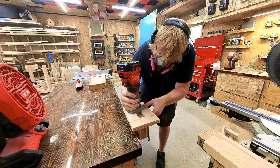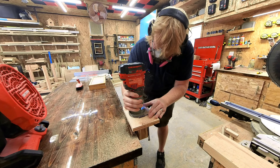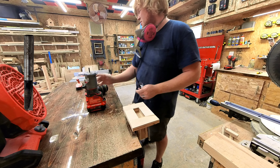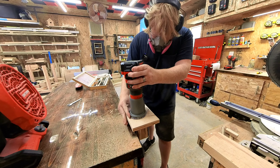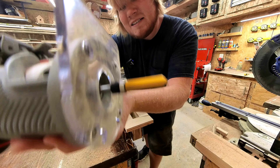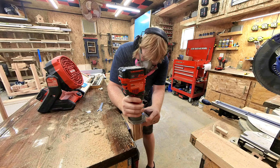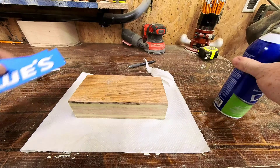Something I completely overlooked: if you are routing out a cavity, especially a deep one, throw a drill bit into your drill press or hand drill and get the depth close to your finish line. This removes a good chunk of material and puts less strain on your router and bit. So far it's perfect — that is as deep as this smaller router bit could go, so now we are stepping it up to a little deeper, more scary router bits. We've reached the point where this is very deep to be cutting with the hand router, so the flat part of the top template is going to become our guide. After each pass I bumped the flush-cut router down about an eighth to a quarter of an inch each time.